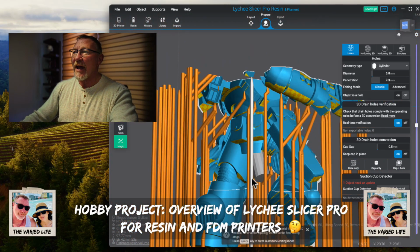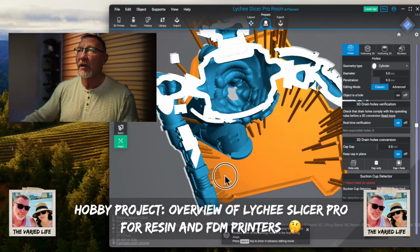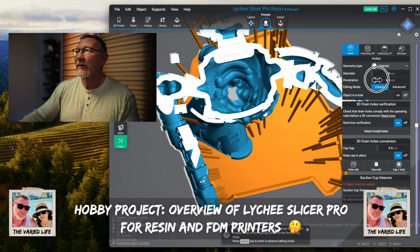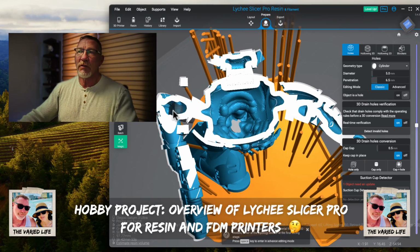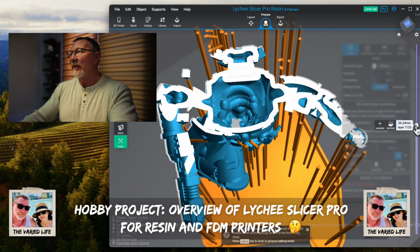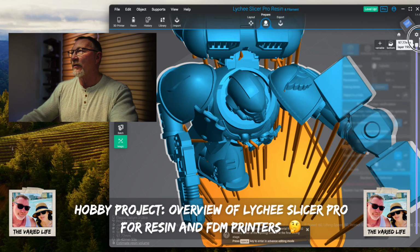So that will allow the resin to drain. Like I was saying, if this was a huge model, that would probably be a good place to put the hole because it wouldn't be in a noticeable area. The hole would be big enough to have that drain hole and get that resin out of there, which would be a good thing because you don't want trapped resin. But what about things like these arms? That's probably not a good thing to have because those areas will just be pockets of resin left over, sealed within that.